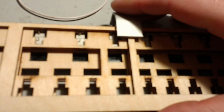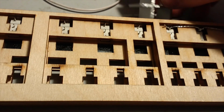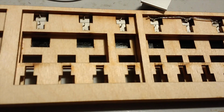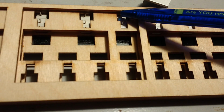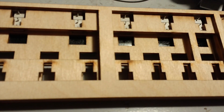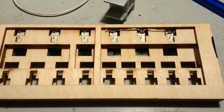This is just a small piece of the aluminium channel. You can see when it's in the channel, it is going to come down like that. So your link wires need to run sort of in a little loop round to the next one, and a little loop round to the next one, so it doesn't foul the aluminium channel. But other than that, you've just got to be methodical.